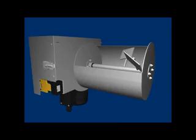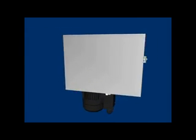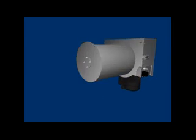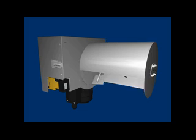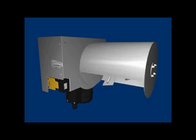The weigh chamber and mixing bowl are one assembly. The weigh chamber is mounted on load cells to measure the weight, which is sent back to the controller to control the material dosing section. After all material has dosed into the weigh chamber, the mixer is started to blend the material together. When mixing is complete, the bowl tips the material into a chute below for processing in your plastics machinery.